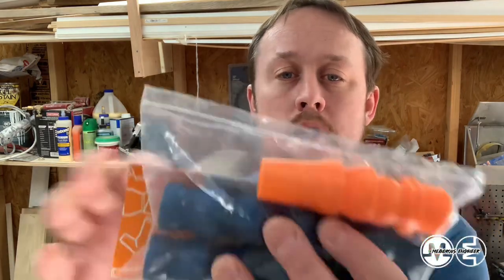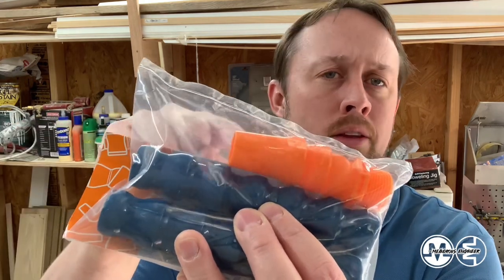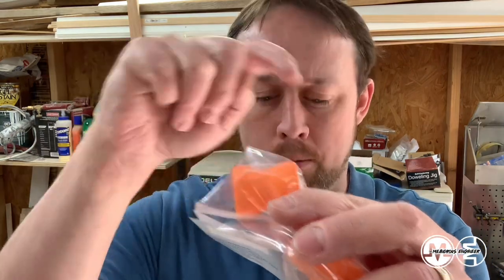So I was thinking about a way to connect those pieces to make it better. And the problem at the top of these Loc-Line is that you have this nozzle that connects to the top of this piece here. And you have to somehow make this miraculously turn into a thread or make an adapter for thread. But here's the thing. If you browse McMaster-Carr's website, I found a double female coupler, so you can couple on both ends here. And if you browse a little further, you can find an MPT fitting that'll fit at the base.